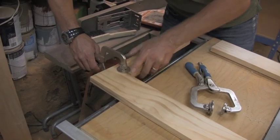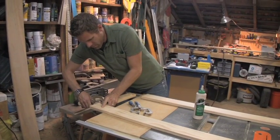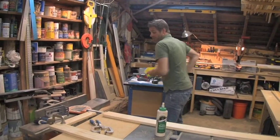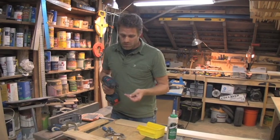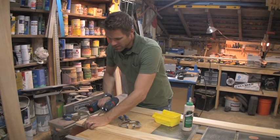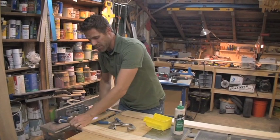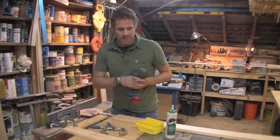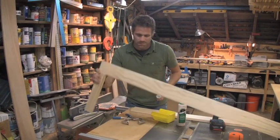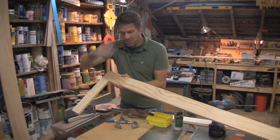Make sure you're completely flush on this side, put them together, and clamp. Then take your screws and run them home. One pocket hole, two, three — there's no way to mess this up once it's clamped. Just run your screws in. The material from a home store can vary slightly in thickness, so there's a chance you'll need to sand, but very minimal. And there's your pocket hole joint — wipe the glue away and you've got a nice tight joint.